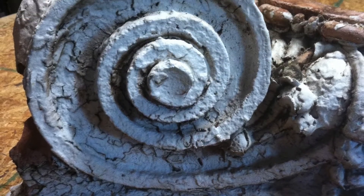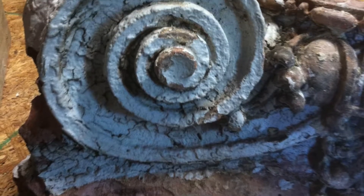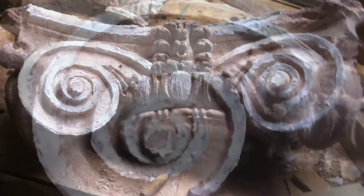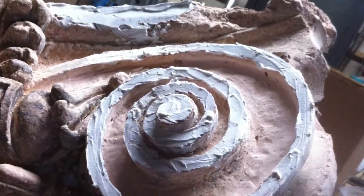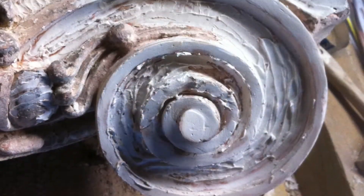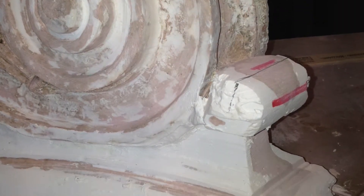To start with, you just pick all the old paint off. Some of it came off pretty easy, but in the little detail — all the little grapes and all around the little crevices — you had to use a dental tool and pick carefully, trying not to pick off any of the original detail. This thing was made in 1872. I don't know how they made it. Today we have urethane molds, rubber molds, silicone molds — they certainly didn't have that. Perhaps they had wax molds, maybe carved in wood and molded in wax. But it was terracotta and horsehair; you could see the horsehair sticking out of it on the back. And you could see their fingerprints where they had pushed it into a mold, so I know it was in a mold somehow.